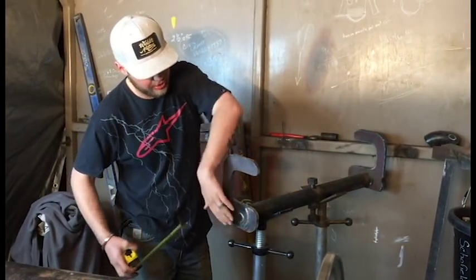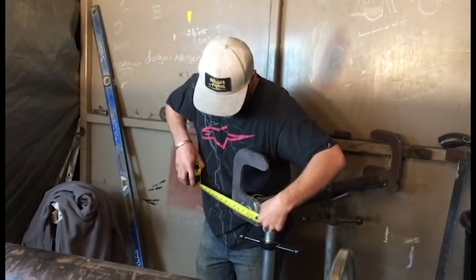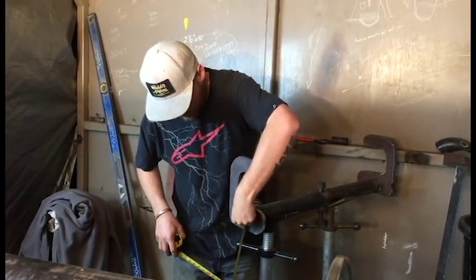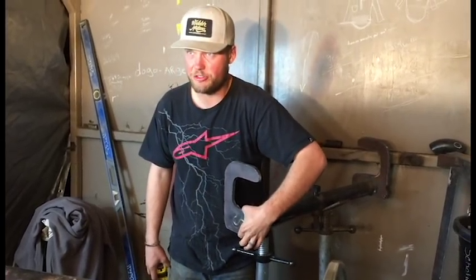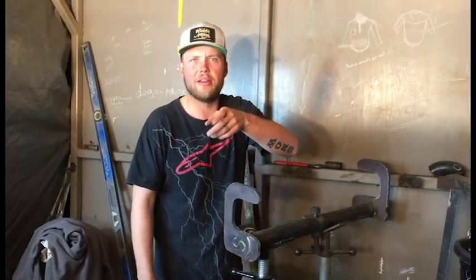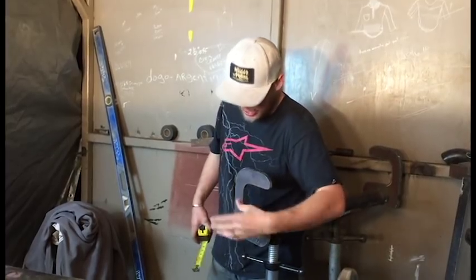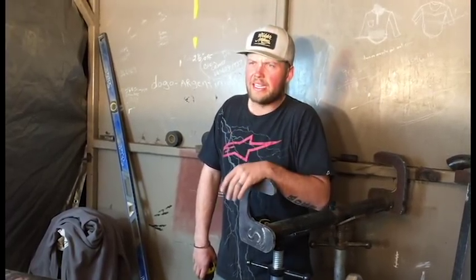So we've got a 28 and a half inch piece of two-inch, we've got a bolt, and right here this is a half-inch plate. The dimensions on this thing are nine and a half inches by six and three-quarter inches. Give or take, you can do whatever you want. The main important part is you're going to want minimum two and a half inches here on the bottom, because this piece of pipe is going to weld over the base of that. So you want plenty of area to run a full weld around it. One and a half inch hole, two inches on the top, about an inch in, three-quarters on the side. You can build it however you want.